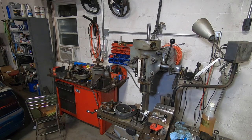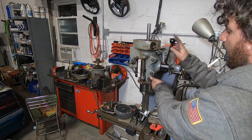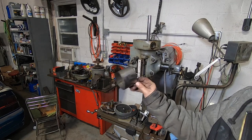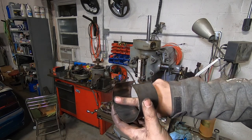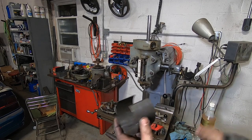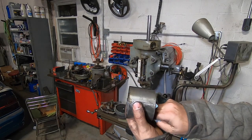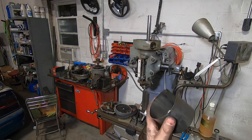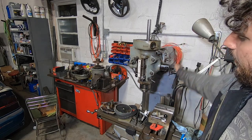Here we are, another project escalating out of control. I had a lot of 'while I was in here' thoughts, and now we're torn all the way down to the quill housing. I had a little tight spot on the quill all the way up and wanted to understand why. I believe this quill skirt was causing it — inside there's some grittiness, galling, and crap in here. It rides up and down within the quill bore for the first two inches of stroke. I'm going to clean up and inspect this part, see if I can save it. With that part removed, the quill is buttery smooth all the way, so that was the issue.